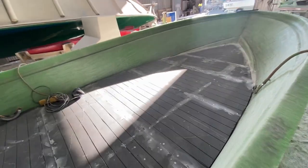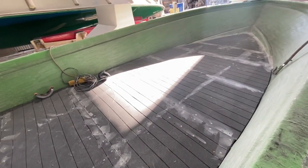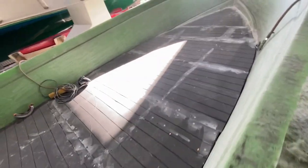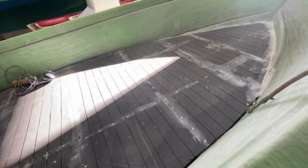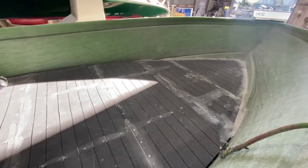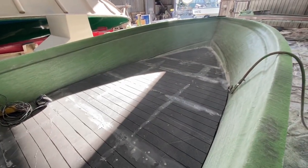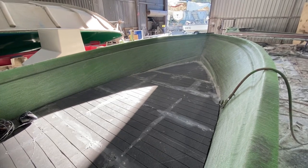Unfortunately I didn't have any photos or video of that but I will put some in so you can see. Tomorrow morning we'll prep the surface — I'll need to tack wipe the whole thing, make sure it's all nice and clean, sand off any high spots so there are no inconsistencies when we're fiberglassing. This will be fiberglassed over tomorrow with about three to four millimeters of fiberglass.